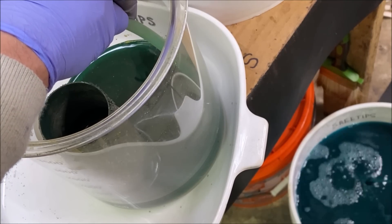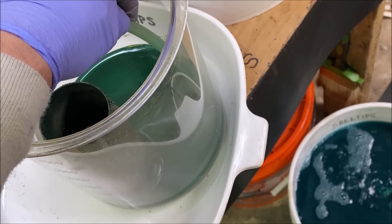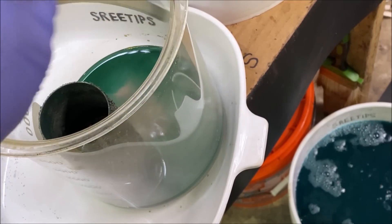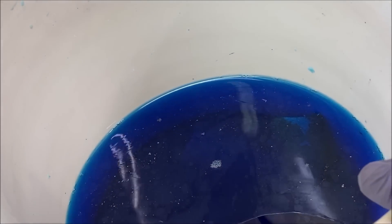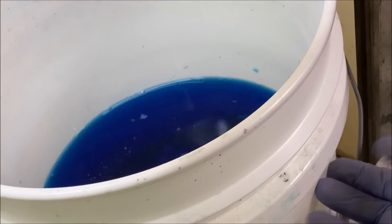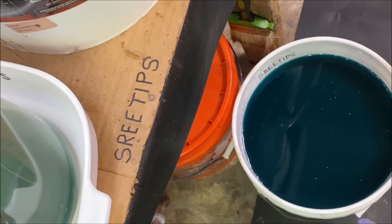If a little silver gets pulled up with this liquid, that's okay because there's going to be silver down in the bottom of my silver refining stock pot. This is the bucket that I used to cement silver into — there's some copper down in there and I need to get the rest of this liquid out, but as you can see, my silver refining stock pot is full.